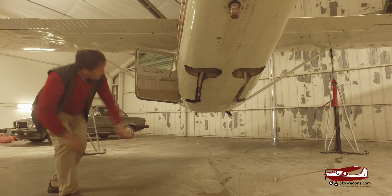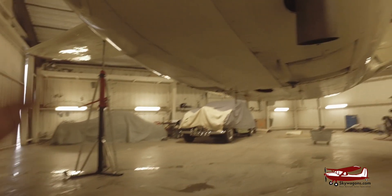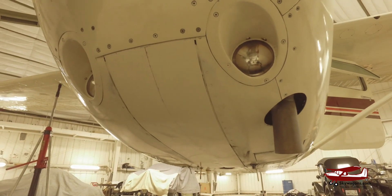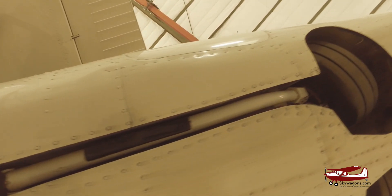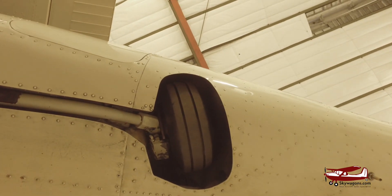It's good to see it every now and then with it fully up like that. Come around and see the front — the gear doors are completely closed. That's it in flight. This is the gear saddle up in the belly, and then there's the gear leg in its groove, and then there's the tire in the well. No gear doors on a 182RG — less maintenance.